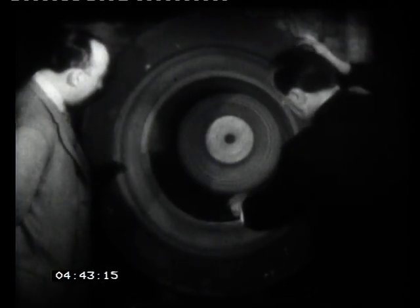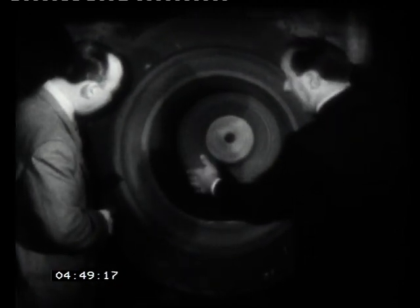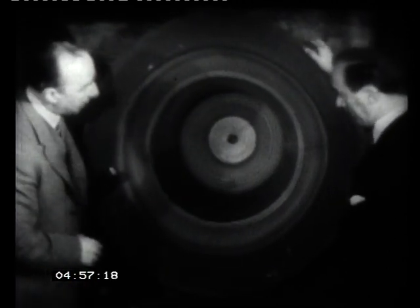Now, you can see the date, 1956. That's because it's mirror fashion. It's backwards, because here it's backwards way on. And it sticks out in relief on the bell, so it'll read 1956. So when the metal pours in, yes, I can see that. Well, let's have a look at the furnace that you've cast them in, shall we?